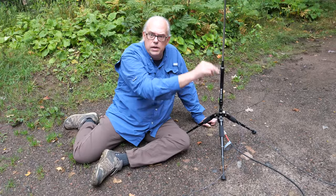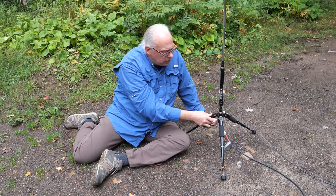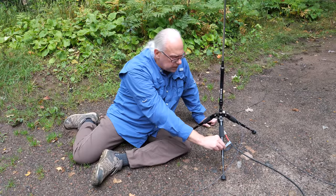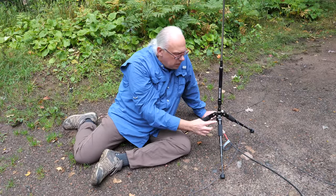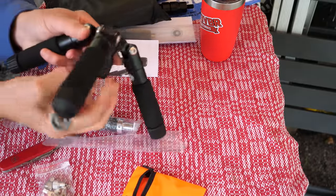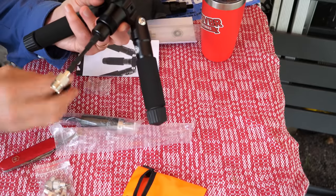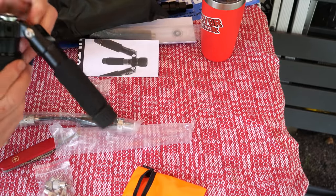I don't have that installed today. Right now as it stands, we can tune it between six meters and 40 meters. The second component is this ultra lightweight tripod. The legs are extendable with a twist-lock mechanism — you can splay them out or tighten them up. There is a removable antenna connector with either a standard 3/8 by 24 thread mount and a UHF SO-239 connector on the other end. It also comes with an SO-239 female connection so you can screw on a coil with a UHF male connector.